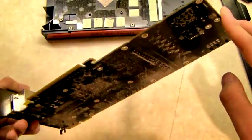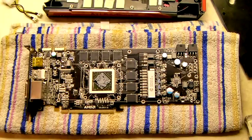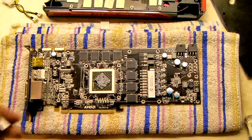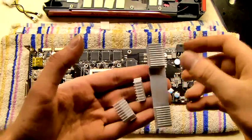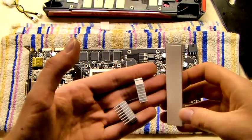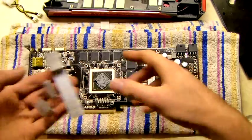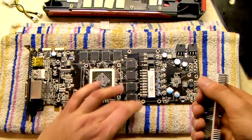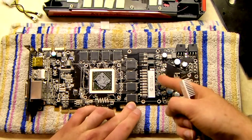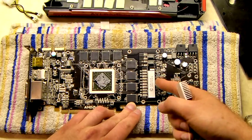So with that off now we can actually look at installing the Twin Turbo Pro. Bundled with the Twin Turbo Pro we have some heatsinks and they come in various sizes. We need to stick them down onto each of the chips here and these ones down here, but there are also some smaller ones which are down there and we have to make sure that those are covered too.